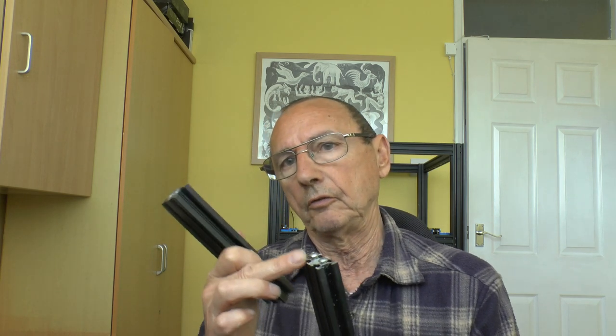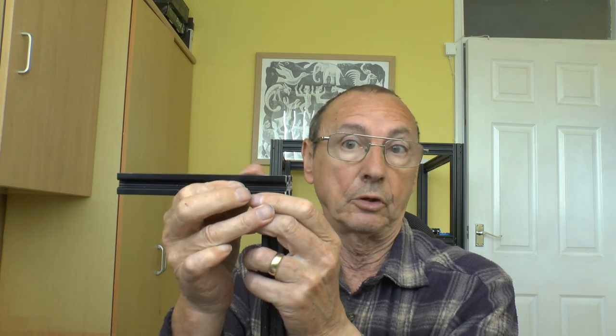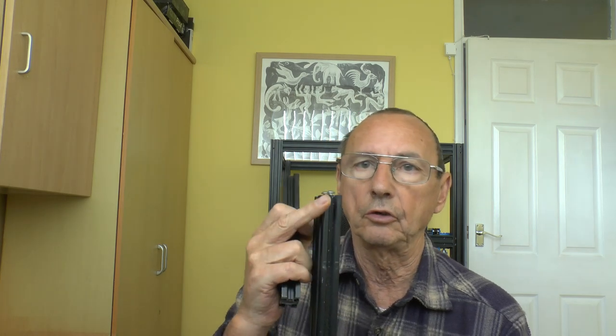The downside is there's very little adjustment, and the ends of the extrusion obviously have to be dead square — you can't adjust if they're not square. So when I'm cutting extrusion myself, some members I had to chop down from what was left on the other printer. I cut them a bit oversized in length and then mill the ends on my milling machine, which makes them dead square and quite a neat job.